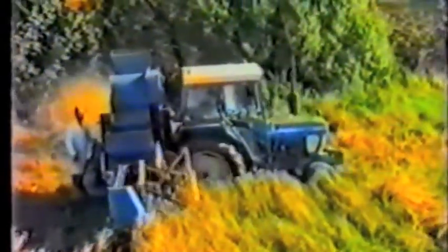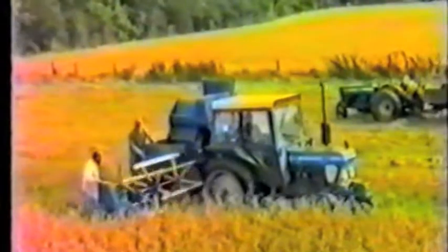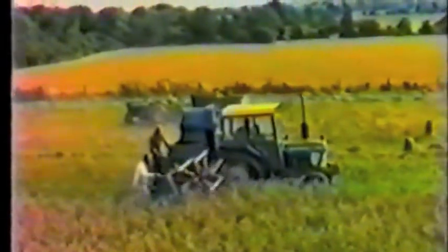The harvester was built in 1987 by Moorfields Manufacturing. It has a redesigned table assembly with increased capacity and versatility. Here you see it working in spring wheat badly infected with patches of couch grass, which is green and very damp. Here we are harvesting autumn wheat, a variety called Avalon. The harvester is working at a throughput of approximately two tons per hour clean grain. The straw is being blown to waste — notice the uniformity of the straw output, which is indicative of the uniformity of the feed from the table.